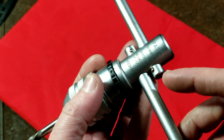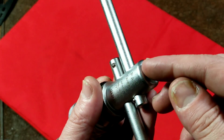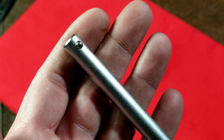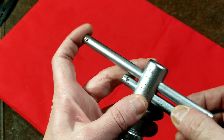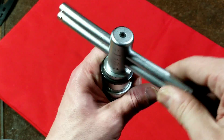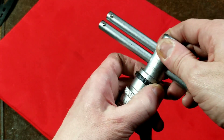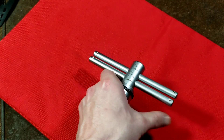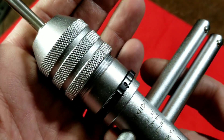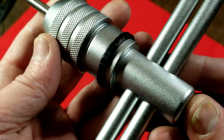The friction balls on the two handles work by drilling all the way through, with a spring and ball on the bottom. The two handles are inserted and there's another spring and ball just under the set screw, then permanently set to keep them from sliding out. Once your tapping operation is done, you can reverse it and ratchet the tap out quickly, at least until the friction drops off to where you can unscrew it by hand. It's a really nice tap wrench overall, especially with the locking center position.